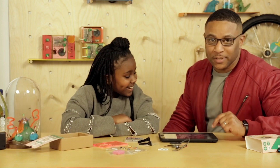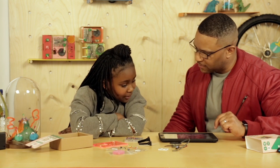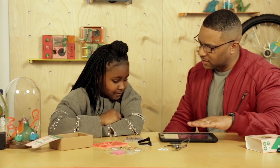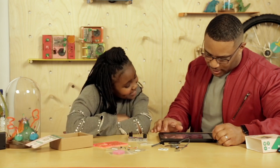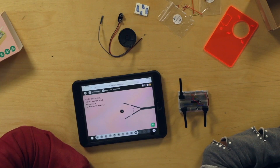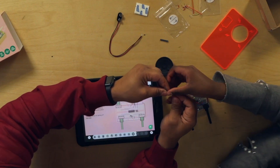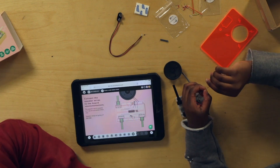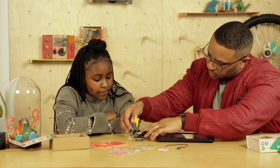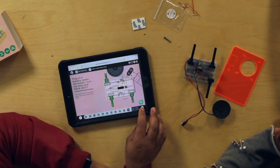Push the potentiometers into place — they need to be flush. You know what that means? Flush means they need to be flat. Goes one to five, so right to the edge. So next we are just going to move on to doing the speaker. Pull off ends, twist wires and separate. Connect the speaker wires to the board. That looks good. So now it's time to assemble it all together onto the box. Secure the plastic casing to the box. Make sure we have it properly.